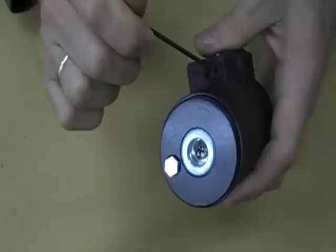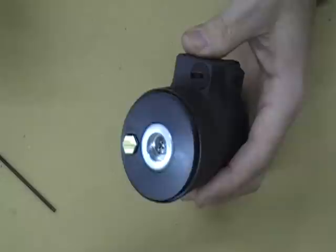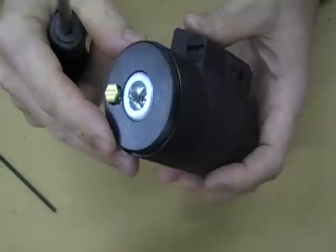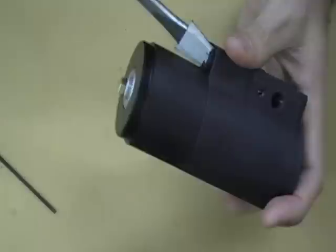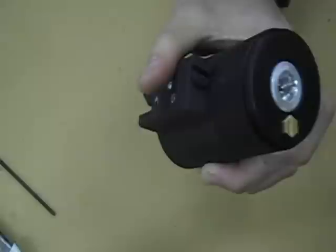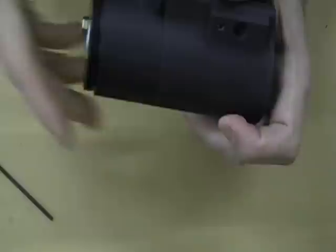The regulator itself is housed in here. This screw slot is the regulator knob. As it sits, it's fully in all the way tight — that is the maximum pressure you'll receive in your unit, which is rated between 280 and 300 PSI depending on temperature and CO2 conditions, or if you use compressed air. To adjust it for lower pressure you simply back it out. When the slot is flush with the unit, that's roughly 200 PSI.